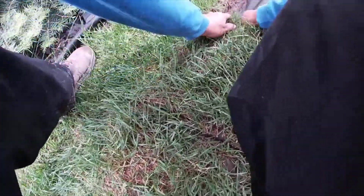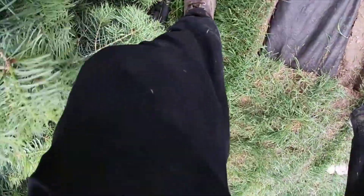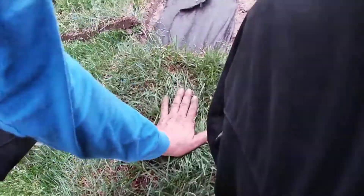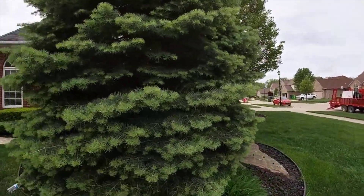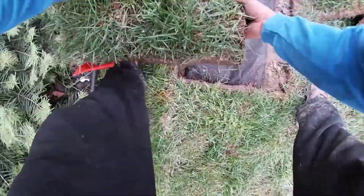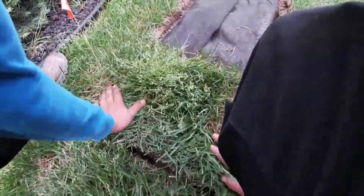Inside the French drain pipe there's a thing known as air pruning — we'll cover that in a whole other video. Basically, the air circulating through the pipe when there's no water moving, which is 99.9% of the time, dries out any root that tries to find its way in. If you put the pipe all the way to the bottom of the trench, you don't leave any water behind for trees to sniff out. Building it this way dries that entire section out and discourages tree roots altogether.